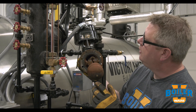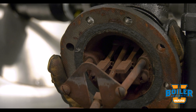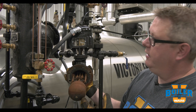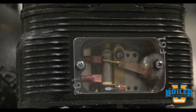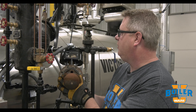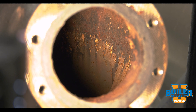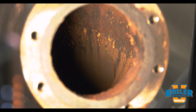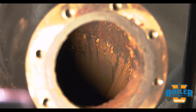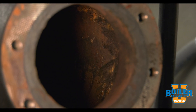These springs are straight — they're not bent, they flex, and we can operate this and actually watch the float switch activate up in the little window. Let's take a look inside the chamber; you'll see we probably need to flush that as well. When our unit's in operation, we can build up material inside the float chamber, and one of the key things we're doing during an inspection is making sure that the inside of that chamber is clear and unblocked so that our low water cutoff functions properly.